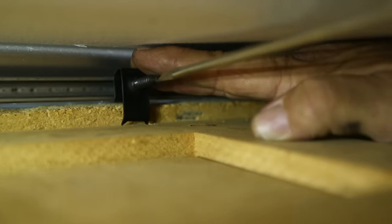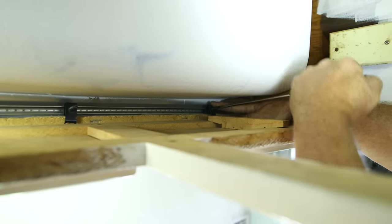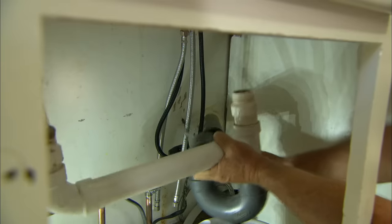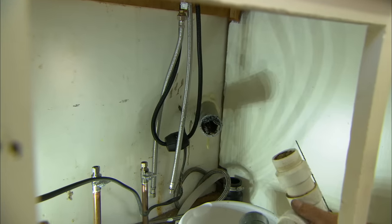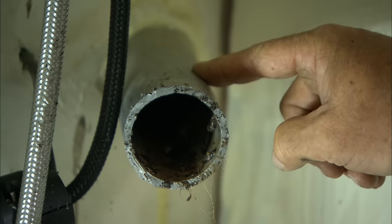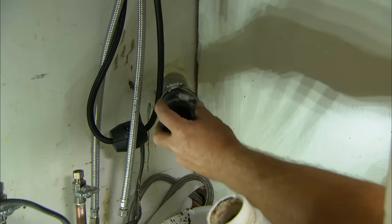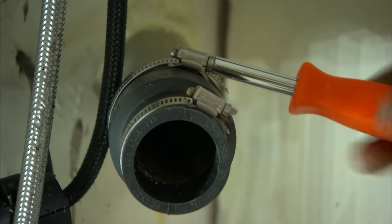The new bowl has one drain versus two, and the existing drain is already glued so there's no adjustment — I'm gonna cut it away. This is two-inch ABS plastic that we rarely use around here anymore. I can't really glue PVC directly to it, and it's also larger than I need, so I'm going to adapt with a mechanical coupling and go from two-inch down to inch-and-a-half. Tighten that up and that'll be perfect.